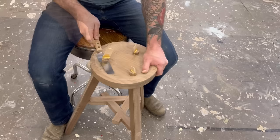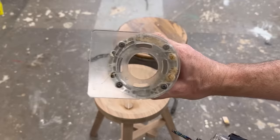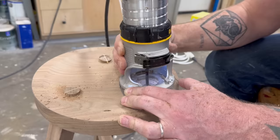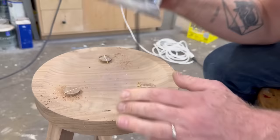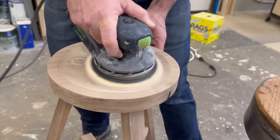Getting the tenons trimmed on the top was a lot harder because of that cove — I couldn't really cut them flush. I got them as close as I could, but there was still a good quarter inch sticking up, which was too much to sand down. So I grabbed a compression bit, chucked it up in my trim router — which just happened to have a circle wide enough to fit over the end of these tenons — and carefully used it as a mini router sled to get rid of most of the excess tenon sticking up through the seat. I worked my way around all three through tenons, then sanded down the little bit that was left over.